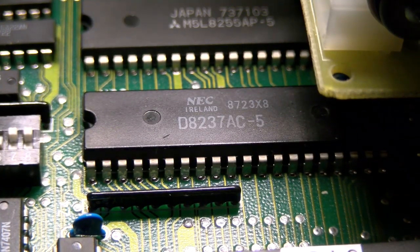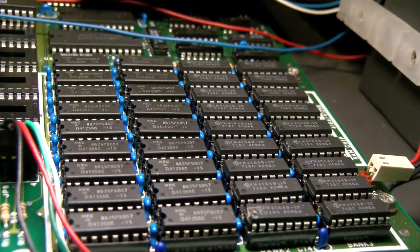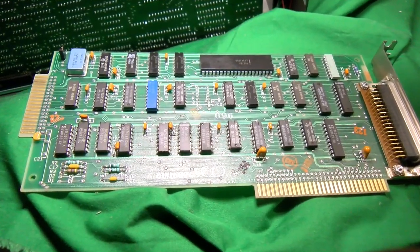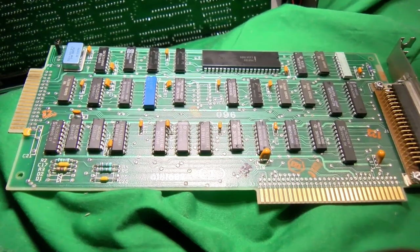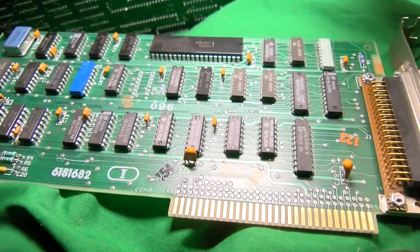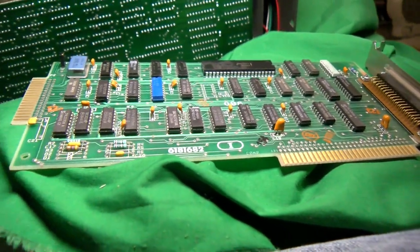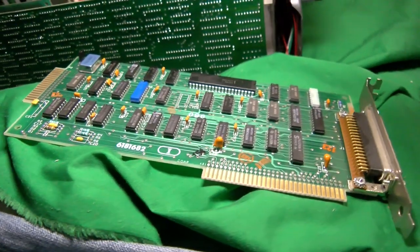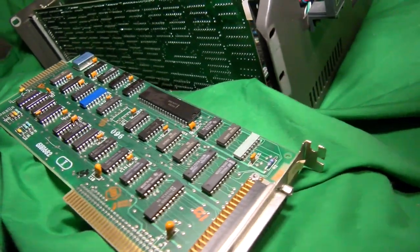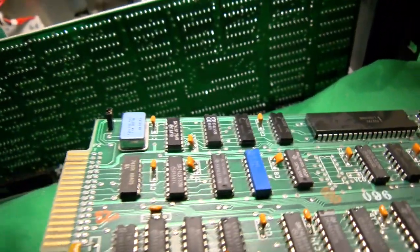In the meantime, for DMA, the DRAM is using DMA0 for its refresh, the floppy's using DMA2, and this leaves us with only DMA1 and 3 for use by expansions. Now, you might be able to get a machine to run without a floppy controller, but pretty much nothing else will even have the option of using IRQ6, as it really is assumed to always be said floppy controller and nothing else. And there we go with the assumptions again.